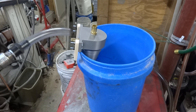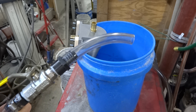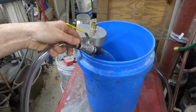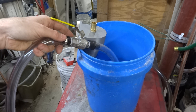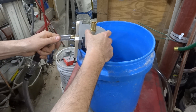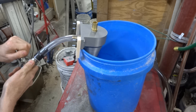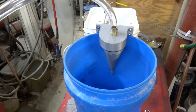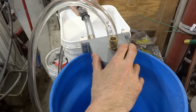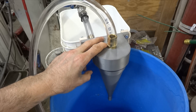Here's a dedicated line I have coming from my slurry pump — a half-inch line I've had forever. That's what I use to remove the slurry before when I wanted to change it out. I would fill up buckets with water, the glass beads would go to the bottom, and I'd dump off the excess. Now that I have the cyclone, I'm just going to plug this in here. I have everything hooked up now, and I'm going to open up the valve here and turn on my pump. The pump is on a foot pedal-actuated switch, so I can do that remotely and let it rip.